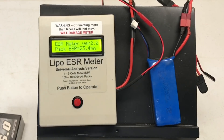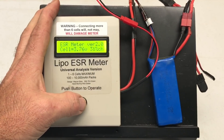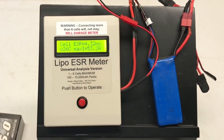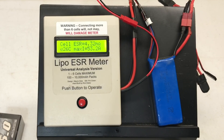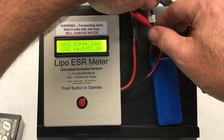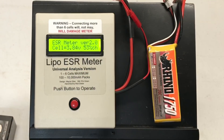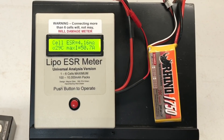So with that, maybe we can get some kind of standardization out there. I'm working on heating up three batteries — this battery is at 94 degrees, let's see if it made a difference. At 26C, 53.2 amps, 4.32 milliohms — pretty big difference, and it's only a 25C battery, so now we're at our rating. This battery is at 107 degrees: 29C, 50.7 amps — that's pretty awesome and it's only a 20C battery. Temperature makes a difference.